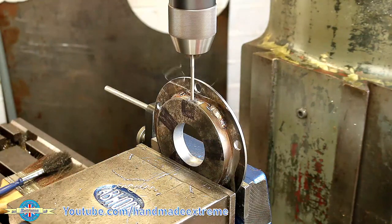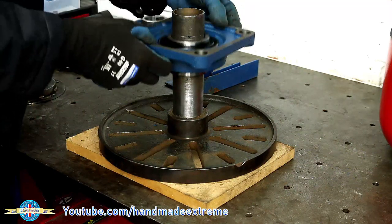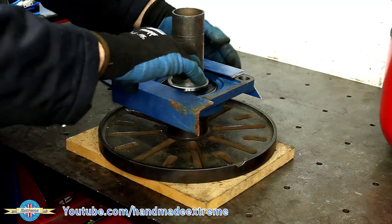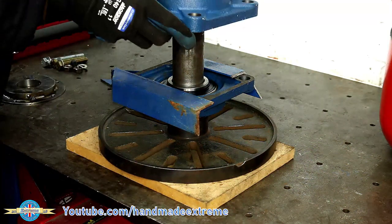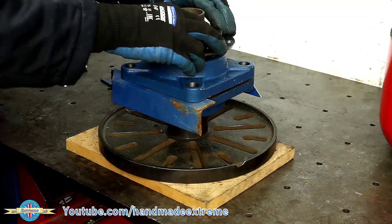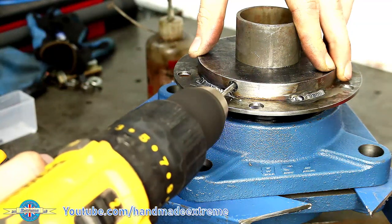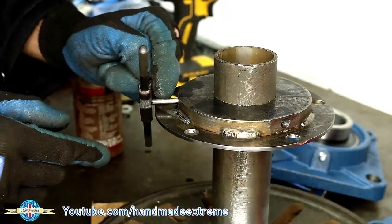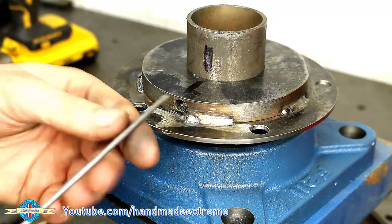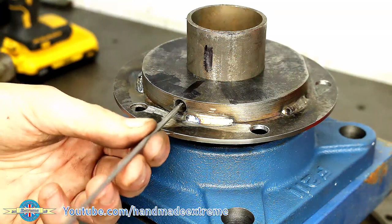To secure the chain ring hub I decided to use grub screws. I put three holes in at 120 degrees apart — these are going to go all the way through and into the axle, rather than just up against it and relying on friction. I then had to build up the assembly on the bench without the housing, using little off-cuts of angle to simulate the space between the two bearing blocks. I could then put the hub on in the correct position, use the tapping drill the same size as the hole already drilled in the hub, then go in with the hand tap and tap all the way through the hub and into the hole to make one continuous tapped hole. I put in a little grub screw and repeated the whole process on the remaining two holes, each time putting in the grub screw to make sure the holes stay perfectly lined up.